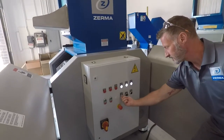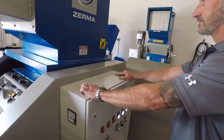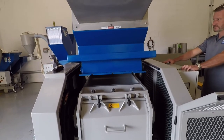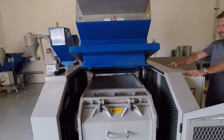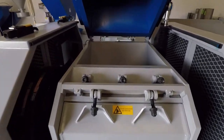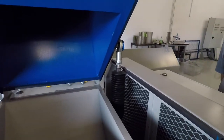We're now going to open up the hopper on the GST 400-600. You just turn the switch and press the two safety buttons — it's a hydraulic jack on the unit, which gives it a nice easy opening to reach the knives. The unit is now fully open. You can see the large bite area that is on this machine, so it can take blow molded parts up to five gallon pails and drums. The hopper on this unit is a fully sound-enclosed hopper, and it's hydraulically lifted.